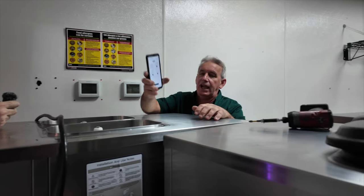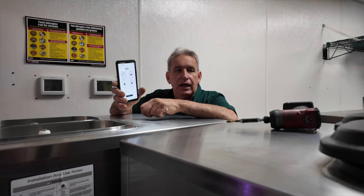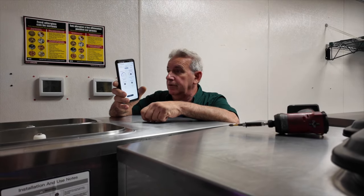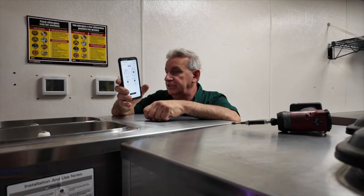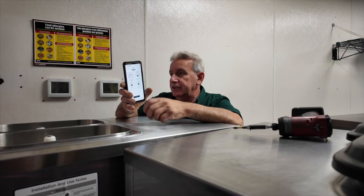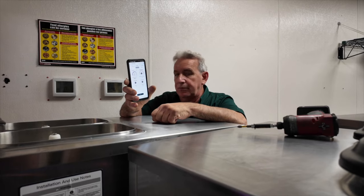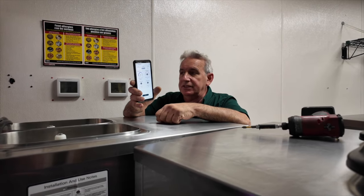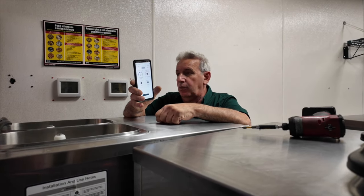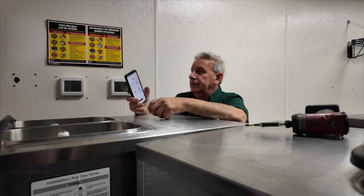It's not running now, but we had the suction pressure down to 40 pounds, the tank was getting cold, then the breaker blew. So we're going to figure out why — whether it's because of a dirty condenser or an issue with this compressor. We believe the compressor on the left side is definitely bad. The one on the right was running, it was getting cold, and now it blew the breaker, so we're going to figure out what's going on.